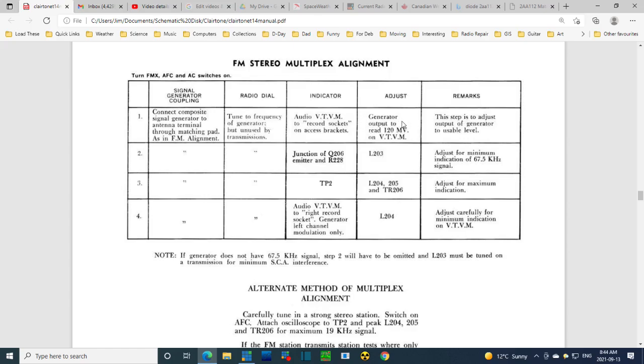One of the things I've learned about this, and different than an AM radio, is these FM radios are very sensitive to being overloaded by test signals and things like that. They end up looking at your scope or whatever it is, and it's just a pile of spaghetti because of these overloads. And it's not necessarily easy to realize that is what is happening. So you could slightly overload the radio and then go ahead and do a bunch of tuning stuff. Bad move. Hopefully I haven't done that. So that's what this is all about, ensuring we don't overload the radio with the signal.